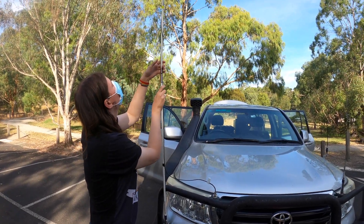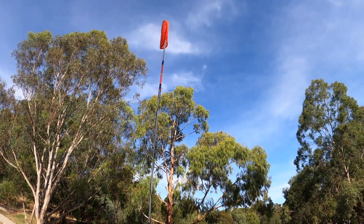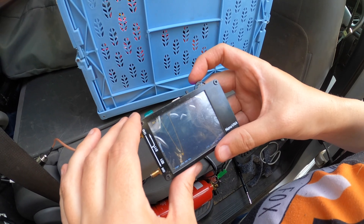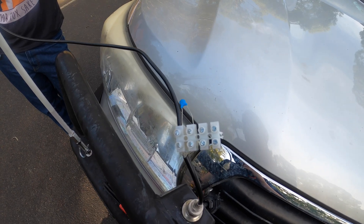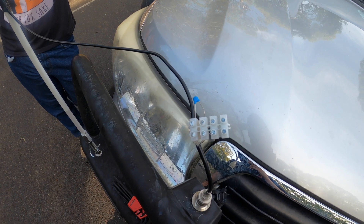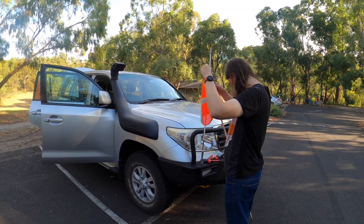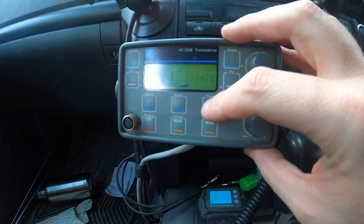So instead we're trying for a design that's a little more top-loaded, and we'll figure out our own capacitance at the bottom. So 1.96 SWR at 8.92 MHz — much closer on first attempt with this design. It seems every value of capacitor we add pulls it further out. 1.8 SWR at 9.04 MHz. It's got to dip at about the right spot. SWR still 1.75, most of the way up.